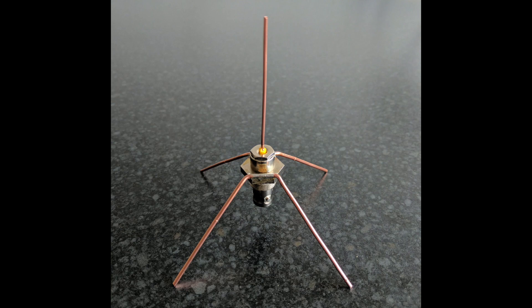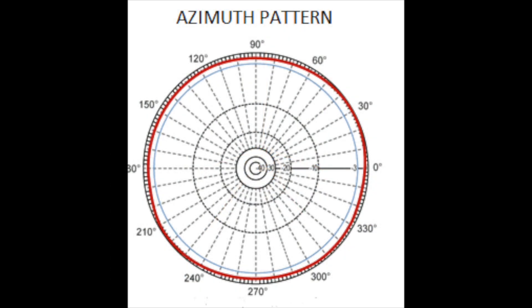Good morning ladies and gentlemen. Today we're going to talk about why a beam antenna compared to a normal ground plane vertical appears to have more apparent power. It doesn't mean your radio is putting out more power — it just means the signal strength is stronger because it's been directed in that direction. This is what a ground plane omnidirectional vertical looks like, and you'll notice it's not a perfect circle because it's affected by some environments, but it's going equally out in all areas.